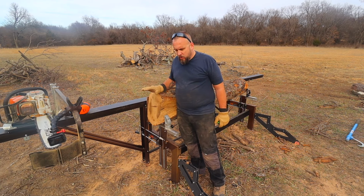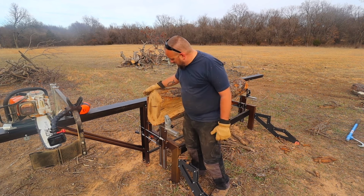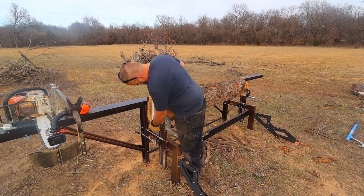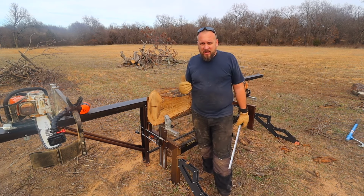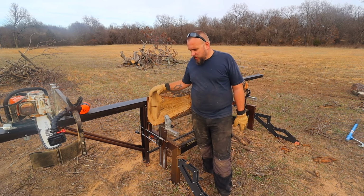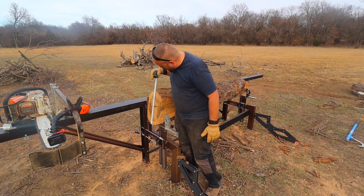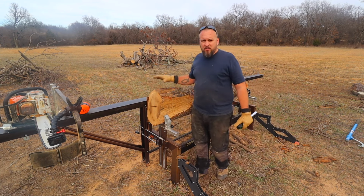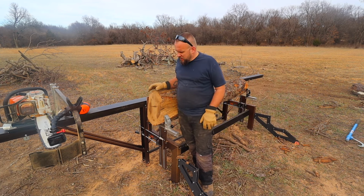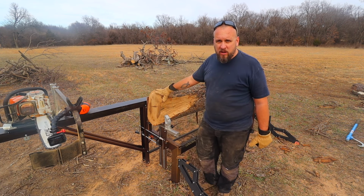In this scenario, I've got to actually center the height on it, and we're a lot higher on this end. We're 9 inches off the pith. The other side has 6 inches, so there is a 3-inch height difference. So there's 3-inch difference in the pith height, full log difference, 16 and a half, and 13. So there's 3.5 inches difference. So I think I need to offset this 1.5 inches. And I think I'll bring that side up 1.5 inches and leave this side where it is.